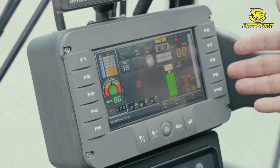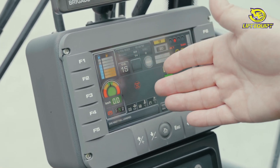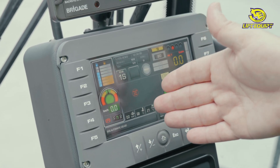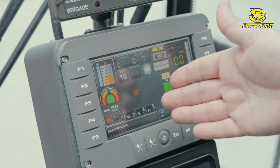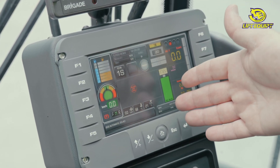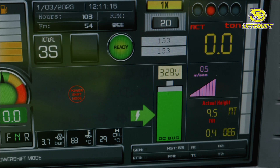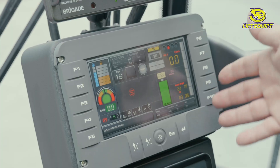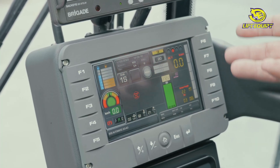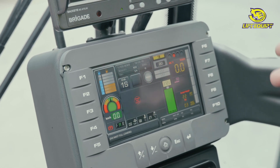In the middle, you have your machine's instrument panels showing your fuel levels, your speed, park brake activators, forward/neutral/reverse, your oil pressure, your engine temperature, and your hydraulic oil temperature. The green bar shows the level of power into your supercapacitors — this will fluctuate throughout the day as you operate. With your regenerative power from lowering the carriage and braking, this will automatically fill back up along with the generator.